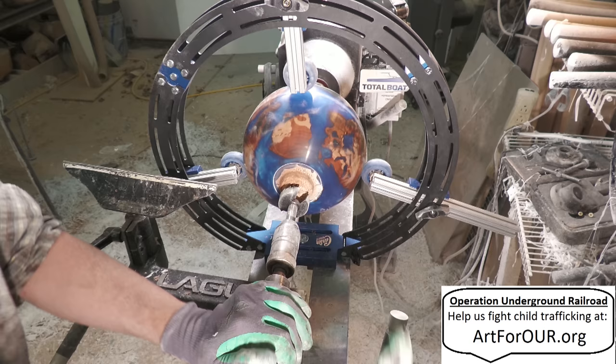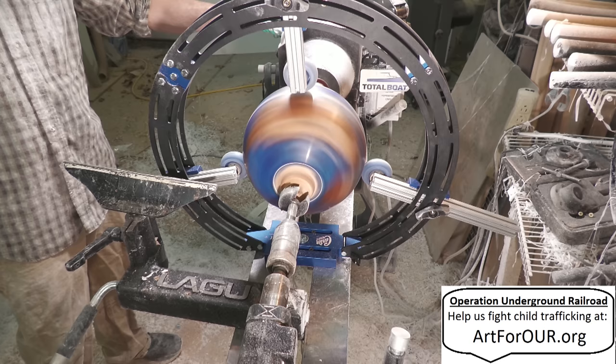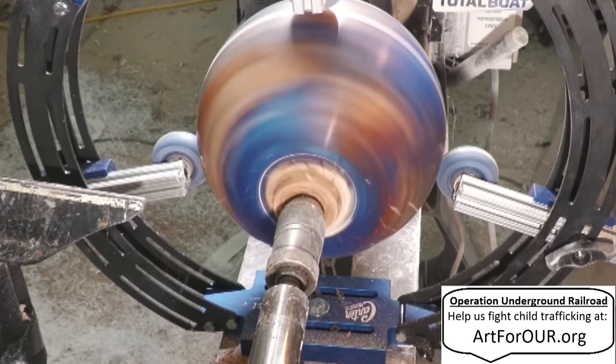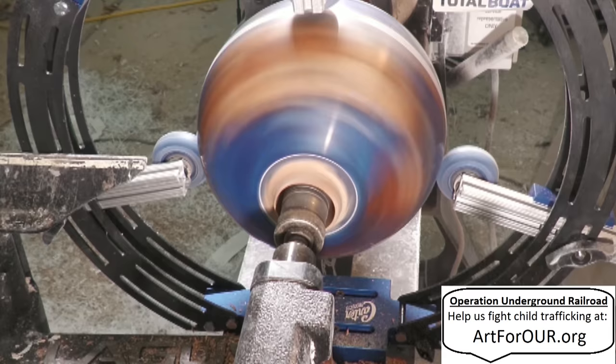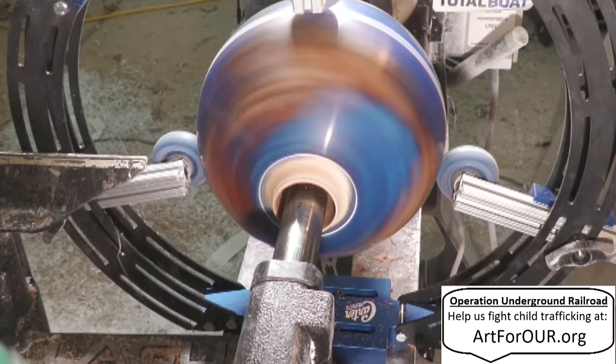It's one thing to put a big project like this in a big bucket and waste 3 gallons of resin. And it's quite another thing to create a custom mold every time to save resin and to keep the walls from getting so thick that they overheat when they set and crack and all that. So this custom molding approach has worked well. The trick is finding plastic that's rigid enough that it can hold up against the weight of the resin inside and the sand or rice or whatever you use on the outside, but still flexible enough to actually use. So I like this stuff. I keep looking for something new, but that's kind of the idea.